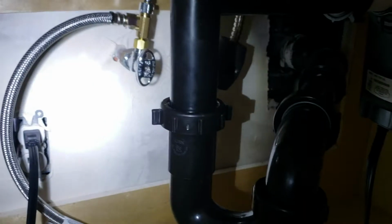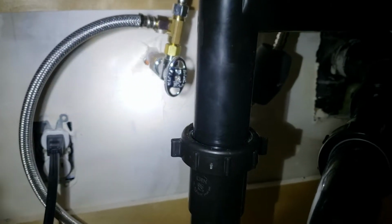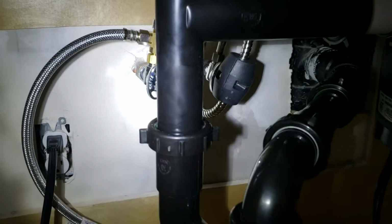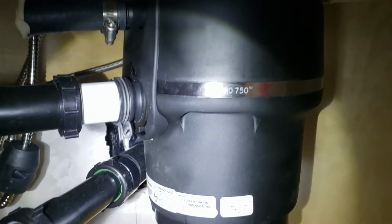All you got to do is turn that valve off, quarter turn to the right off, and then take that off right there. Take this supply line, the whole thing out, and tie the dishwasher. Should be a 3/8 braided line, tie it in right there. And so then turn the water back on. So that's good. Over here, we knocked out the plug for the disposal.